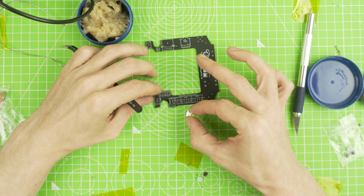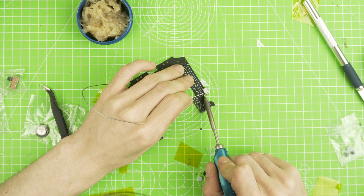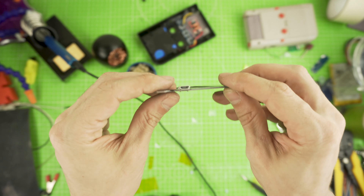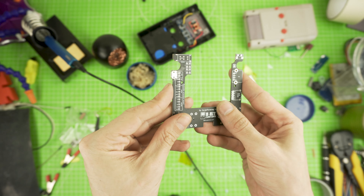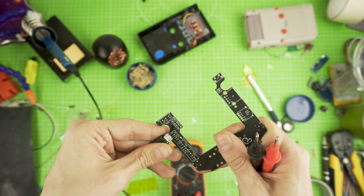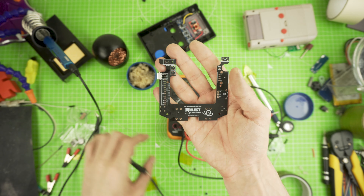We will start with the micro USB power-in connector. This is the trickiest solder job on the board, but don't worry — if you plan on using this board it does come with the micro USB pre-soldered, either naked board or fully soldered. Once soldered, it should look something like this. A good practice is to check with a multimeter after every component soldered, as it's a lot easier to fix at this stage rather than later when it's already mounted inside. Check it with the power plugged in.